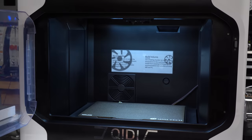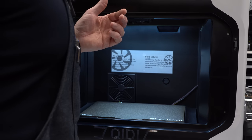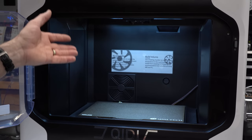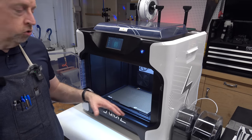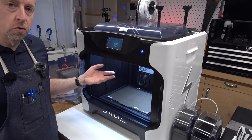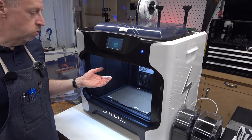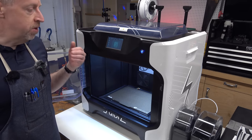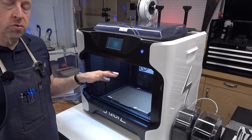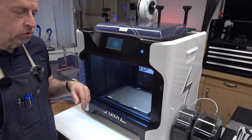For that bulk, you get a relatively large build volume. The plate says 360 by 250; the manual quotes 330 high by 250 by 320 millimeters — a sizable build volume, bigger than a typical 200mm printer and similar to my 300mm square printer, except rectangular. This is a dual extruder printer. There's a low-temperature version with brass nozzles going up to 240°C, and a high-temperature version with hardened steel nozzles working at 250°C and up. Highest I've printed is 280°C for nylon, but they quote other materials at 300–350°C.